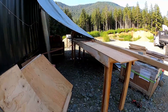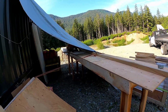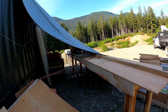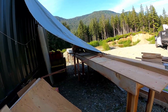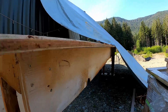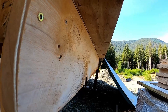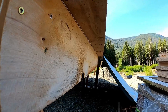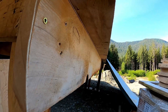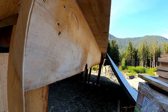We got the table all built and in place. Now the next part doesn't have to be level lengthwise, but it does have to be flat, so that's what we're doing — making sure that it's flat. We're just taking this string from both ends, and then we'll move the table to where the string is right along the top edge and flush with the back. Once we do that, we'll level it up.